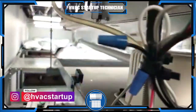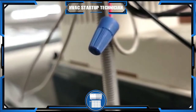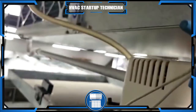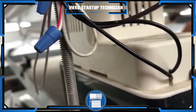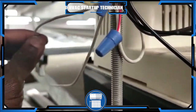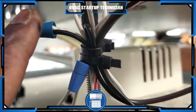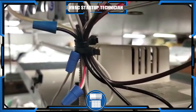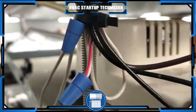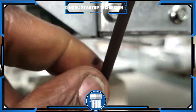What we're doing: you can see we have those two white wires here. If you have a condensate pump and you look at it, you will see two black wires coming from it. You're going to take one end of a black wire and one end of a white wire and wire-nut them together. In this situation, the wire wasn't long enough to reach the board, so we're using a piece of thermostat wire to extend and make the connection.